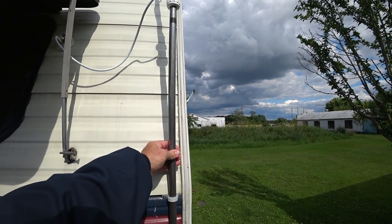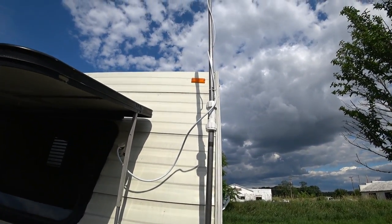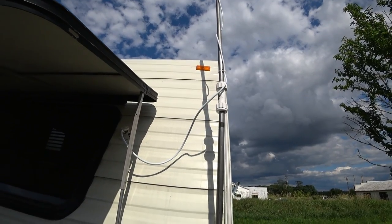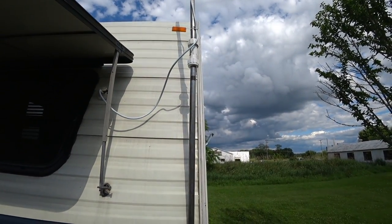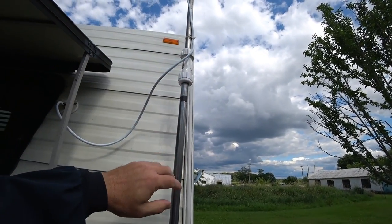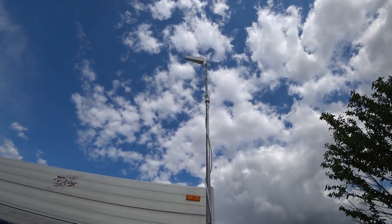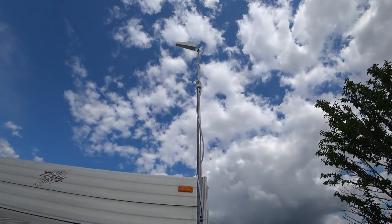This is stainless steel conduit. I've had it laying around — it's three three-foot sections put together with couplers meant for plumbing, and also some slip-fit copper joints. This is three-quarter inch and it slipped right inside the copper, so there's a copper sleeve holding the two pieces together with compression. To get those copper sleeves into the plastic, I heated up the copper and pushed it in while hot to melt the plastic. A little tricky, but it got done. Up top, I put the round tube in a vise, squeezed it flat, and drilled a couple of holes for mounting.